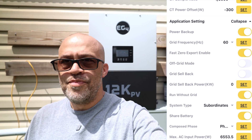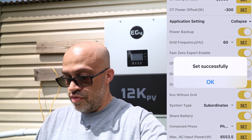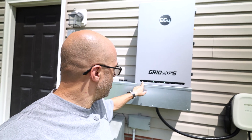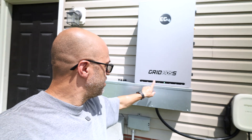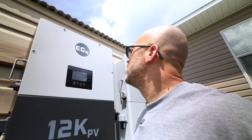Now I want to turn the grid assistant off and see what happens — see if we can kick these inverters out. I'm going to go ahead and change that in the app and turn the grid assistant off. Basically I'm going to put it in off-grid mode. I went ahead and unplugged the car, and now you can see the grid is off — it's probably pulling everything from the inverters. Let's go back on the app. Right now the inverters are showing about 12 kilowatts going to my loads.